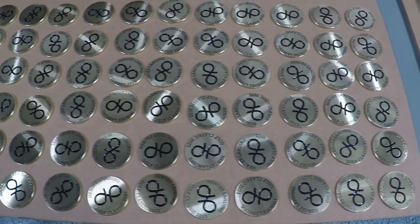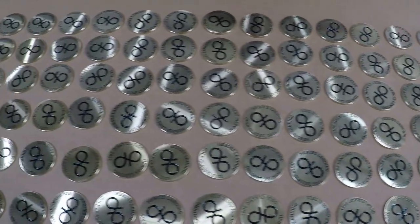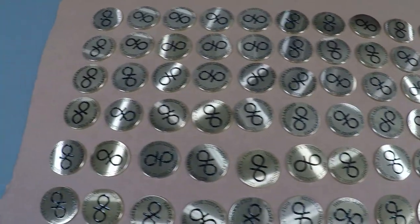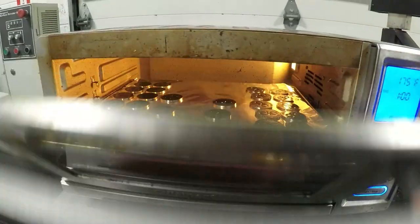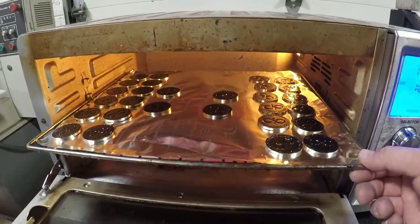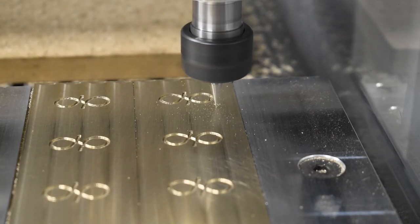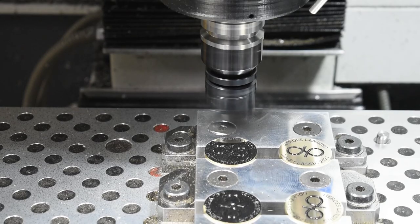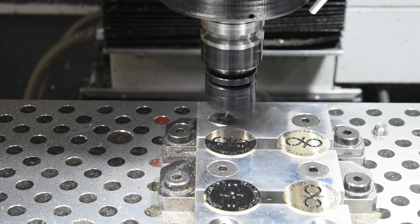This was kind of a tough project because I had to improvise on so many things — there was a little variance here and there. I did find that in the oven at higher temperatures, above 175, the brass did turn darker, so that might not fit with the aesthetic. I enjoyed using both the Tormach 24R and the Tormach 1100 MX — each one did what it was good at: high rpm for the router and low rpm big tools for the mill. A big shout out and thank you — Vince did such an awesome job on these ball markers and they were a huge hit at the event.